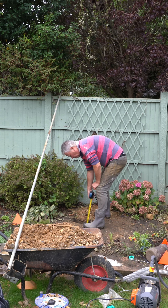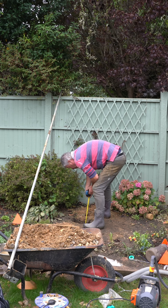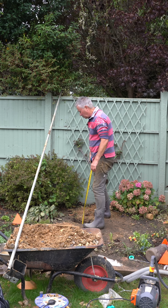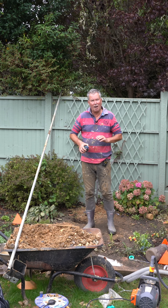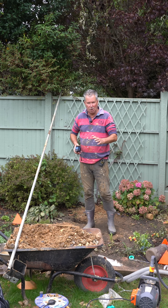At 1 meter 90 I hit water and I have drilled down to 2 meters 90 — just short of 3 meters down — and I have 1 meter of water. I'm going to do a little bit more but I feel I've hit a stone now that I can't move, so I'll probably call it a day.